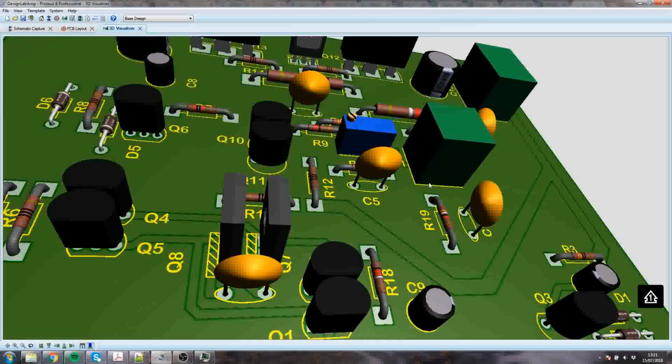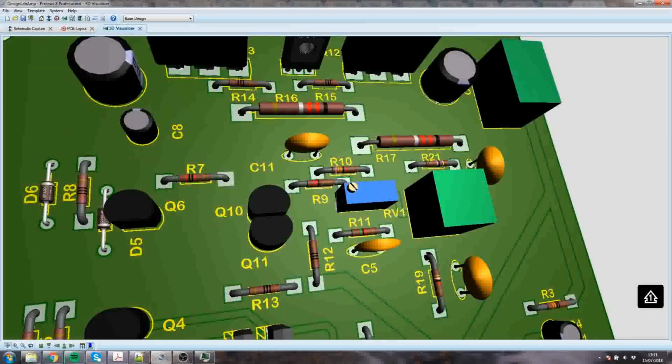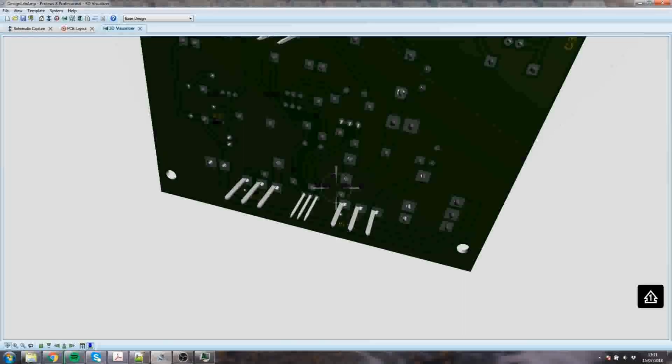I can't get the soldering iron under this green block, which is supposed to be the terminal block, because it meets the board. It's not like the leg of this capacitor, where I could put a bit of solder there if I needed to. No chance. So if you solder it, it has to be on the bottom side.